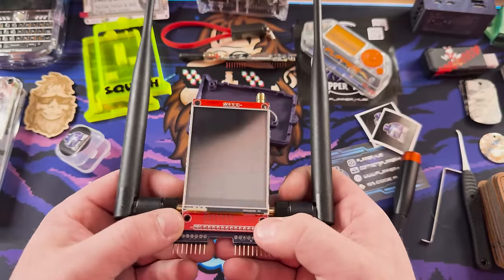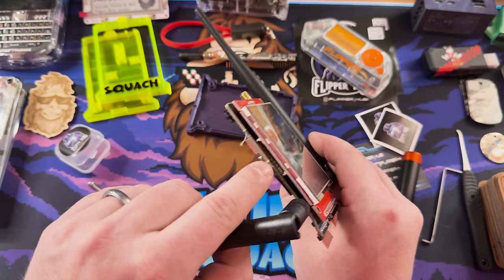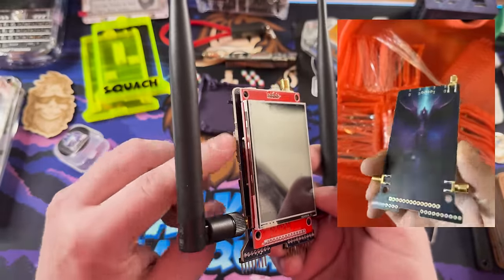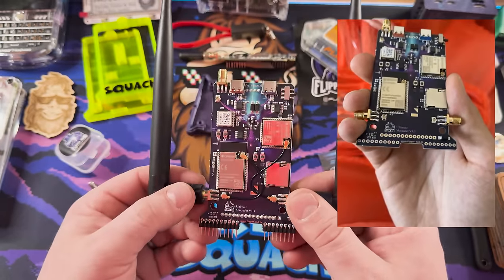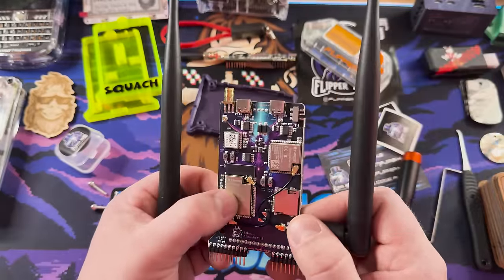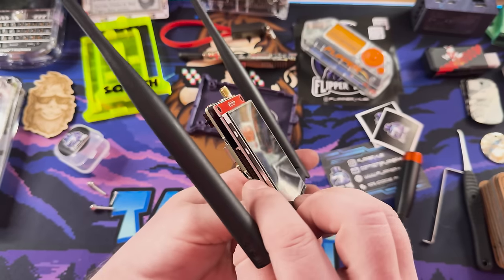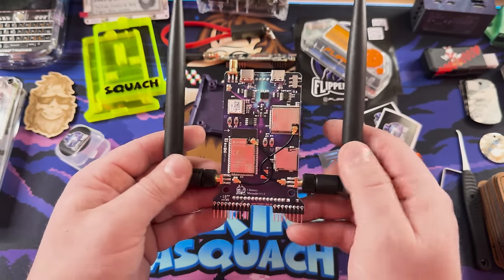Interesting — he's actually using the full board on there. The full board even has a full-size SD card slot that's part of the display. It's soldered to it because there's silk screening on the baseboard on both sides. Unfortunately I can't really see all of it, but very, very cool silk screening. We've got our two ESP32s: that's the Rover, and that's the Room. This is our micro SD card slot that we're actually using instead of the full-size SD card slot still on the screen. Here's the GPS antenna and all the other bits and bobs that make this thing work.